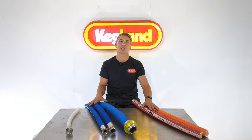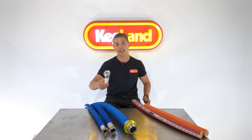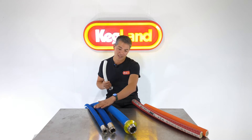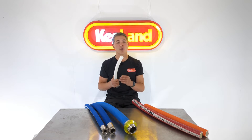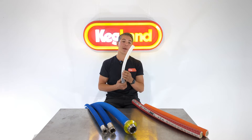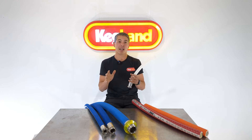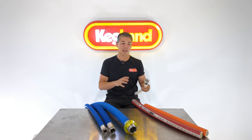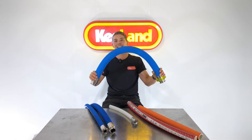If you want slightly higher chemical resistance, you've got the EPDM ones. The other thing to mention is silicone as well. This is our braided silicone hose — this is kind of like the cheapest option. Unlike the butyl rubber or EPDM, this one doesn't have a helix inside. So if you're using a strong pump which is really sucking hard on the hose, this may not be the best option because it can actually start to collapse the hose. For small homebrewers I do love the silicone hose because it's really flexible — you can bend it around tight radii, while these other hoses have larger minimum bend radii.